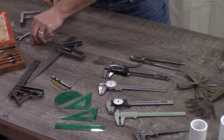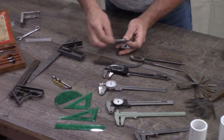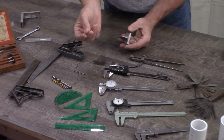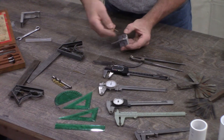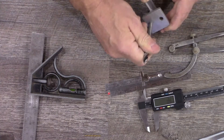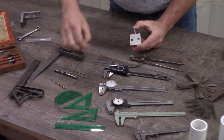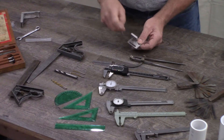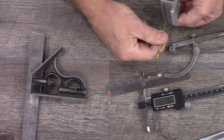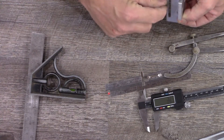Another common tool is drill bits. The size of drill bits can be compared against material thickness — if it's too thin or too thick, find one that's nice and flush on the sides, and the size of the drill bit is the diameter or thickness of the material. For instance, if I needed to find the inside of a hole, finding a drill bit that fits really snugly in there will tell you the size of the hole. Or for the inside radius of a feature on a part, a drill bit that fits just into the slot tells you the diameter or width of that slot.